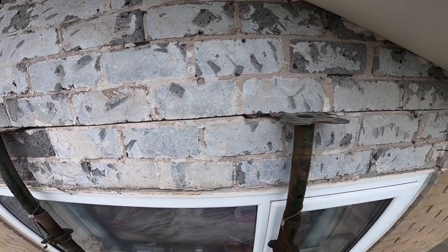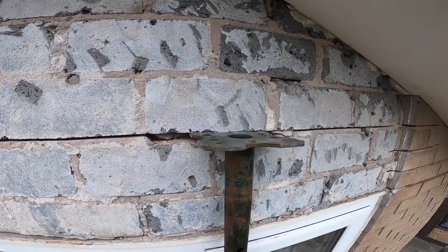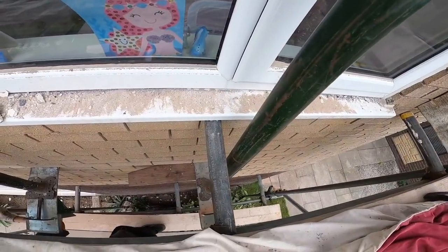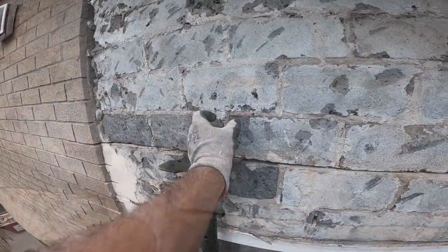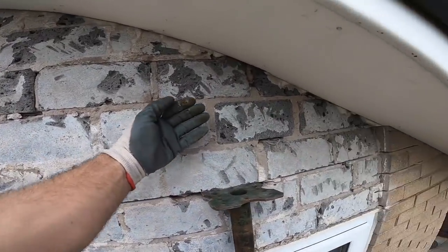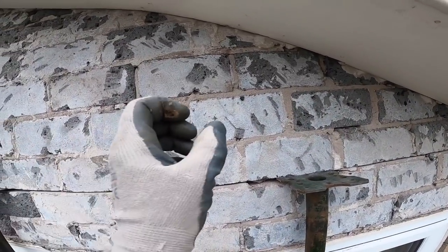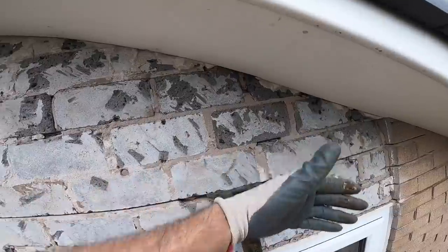There we go, we're propped. There's not exactly a lot of weight on top of this one. But we've got the Acrows in, down to the strongboys there, which are fixed in the wall. I keep meaning to try those expansion things that Tim Margerson keeps telling us about, but I think if we use them here, they just push the brickwork off. They're designed to put pressure on the brickwork so it won't drop, but with this being top of the pike, it'll just push it over, I think. So this will have to do.